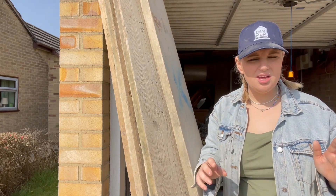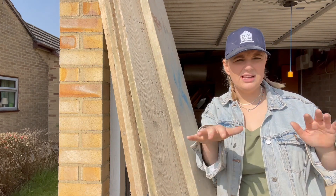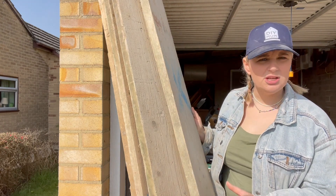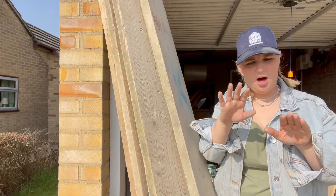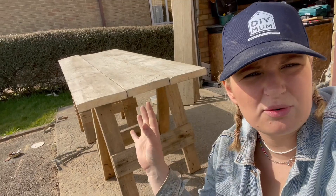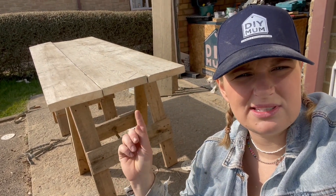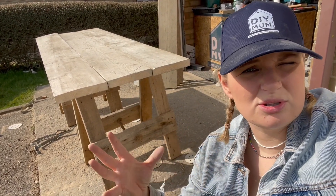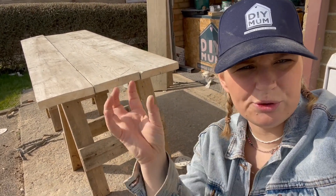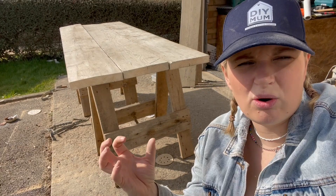I'm going to place them on my worktop. I don't have a great surface area and haven't really got a level area in my house, so it is quite difficult to pick the best boards that aren't warped. I'm going to make sure the grains are alternated so that it will stop any cupping happening. I'm putting three boards together for this breakfast bar, using glue and clamps. For a bigger table I'd put steel C-bars underneath. I've been told that biscuit joints and dowels don't actually make it stronger — they're just more for alignment.